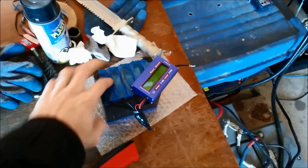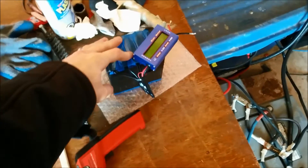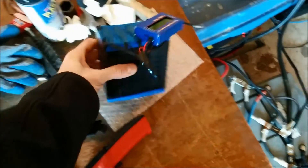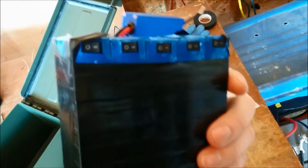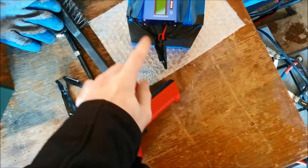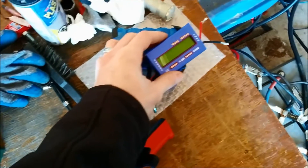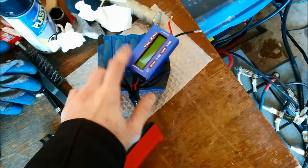I'm starting my new ammo box project with my lithium polymer batteries — about 20 amp hours in this tiny little pack. They have really thin wires coming out, two positives and two negatives on each side, so I put them all in parallel to pull the current I want. I have it coming through a watt meter, and I've marked out where it's going in the box. I'm putting the batteries on this side and the watt meter here.